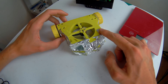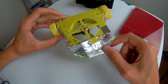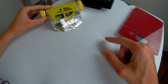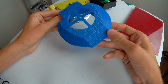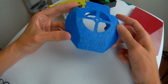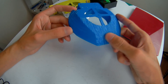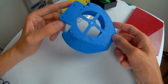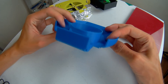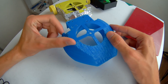It is time to move on and get on with the actual fusion. I don't want to keep the chassis the same because, while it is good, it doesn't look as good as it could. Since we're doing a rubber makeover anyway, we're going to do a full makeover. I've designed a new body for Downforce — or at least a trial run at the new body. It will have an ABS section at the top and then rubber sections down the sides for the outside armor. We'll take everything out of this, put it into the new prototype chassis, make sure everything fits, and then get the rubber chassis going.